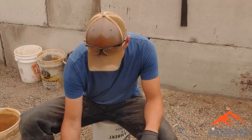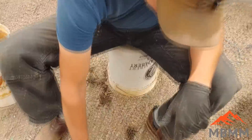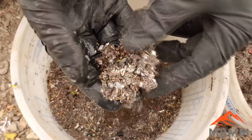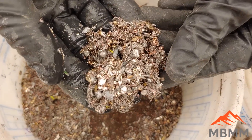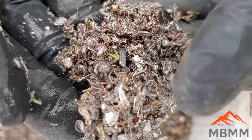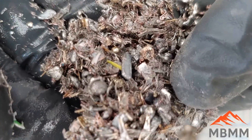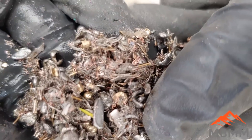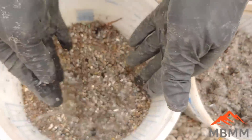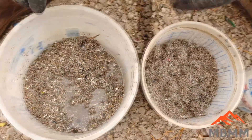Here's our stuff from the ribbon cable that came off the shaker table. We've got three different samples. Starting with number one — this is where almost all the gold pins went. There's quite a bit of copper wire in there too, but all the gold came across here. So that's our number one high grade.